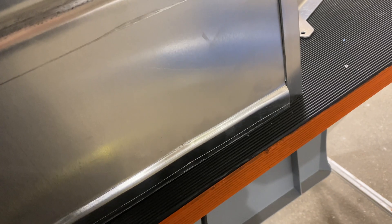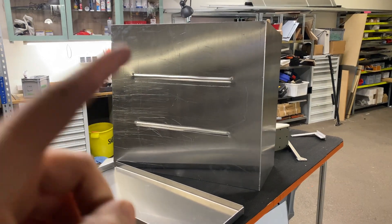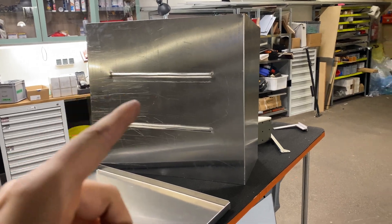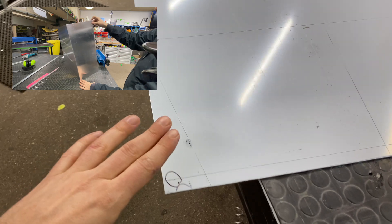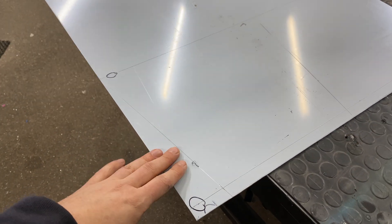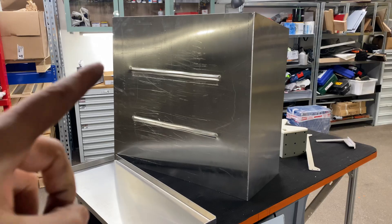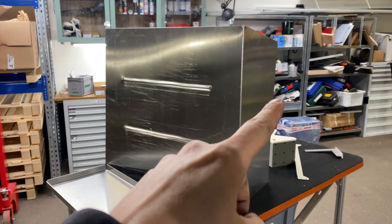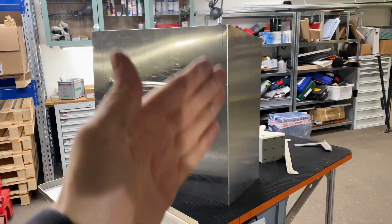The top part will be behind the part on the right and the bottom part will overlap over the bottom. If you're a real professional you take the wrong measurements and do it all over again - but this time you do it properly. I'll cut out these little ears up here right now and also cut some holes for hand holes. I wonder if I can form the beads first so I don't have any distortion since the beads go all the way around, and then still be able to bend it.